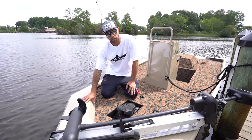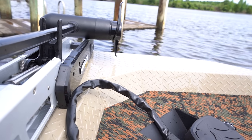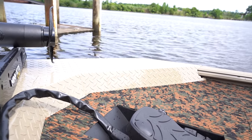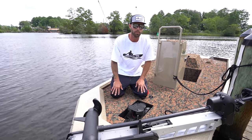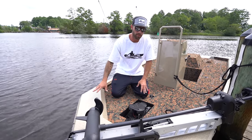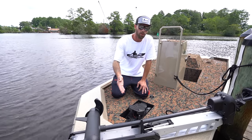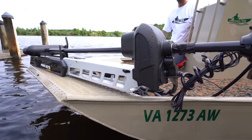This whole part of the bow was fabricated by me — all of this diamond plate. He brought me a couple sheets of 1/8-inch aluminum diamond plate when he originally brought the boat and wanted to use that for this bow. The way the old bow was in here, it was just gonna be impossible to make work, so we built all this. It really gives it an industrial look, it's heavy duty, and it works out really well. We mounted this Minn Kota Ultrex up here and it just works perfectly — fits right up here.